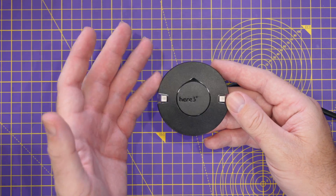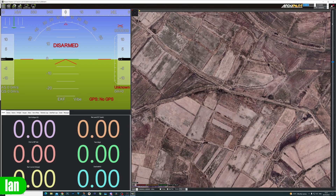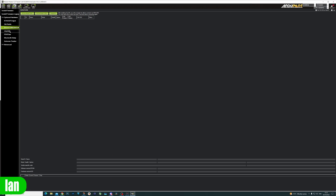The final thing I'll quickly show you is how to look at the settings for the CAN bus on the module. Back in Mission Planner, make sure you are disconnected and change the COM port to the next number down — COM port 34. Go under Setup, select DroneCANslash UAVCAN, and select SL CAN mode CAN 1. That is for CAN port 1; if you wanted to look at CAN port 2, select CAN 2. Click OK, and you will see the CAN bus devices connected listed here.